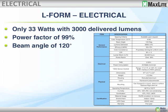Controls are everything these days with LEDs. The fixture is just about 4 feet at 47 inches and only 6 pounds each. The translucent polycarbonate lens is just milky enough to diffuse all of the LEDs so that it looks like a solid scope of light — like a linear T8 — but it doesn't hold back the light, so the lumen light-loss factor is still very small. We will have UL or ETL equivalent. This product is RoHS compliant for California and our European customers. We are looking for indoor damp location rating, and the LEDs are all LM80 rated.